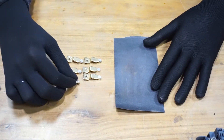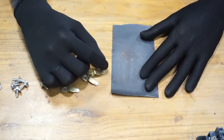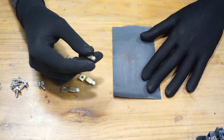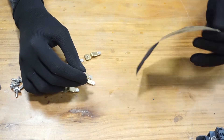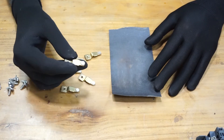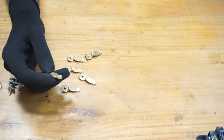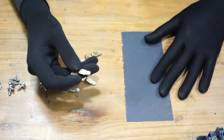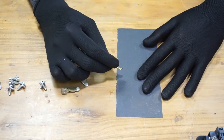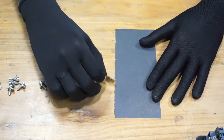The sandpaper you use to clean the contact points depends on the amount of damage or the depth of the grooves. If you have large blows or the damage is severe, use a coarse or medium grit sandpaper first, then move to the next. I'm going to start with 400 grit — in this case I don't have much damage to the contact point.